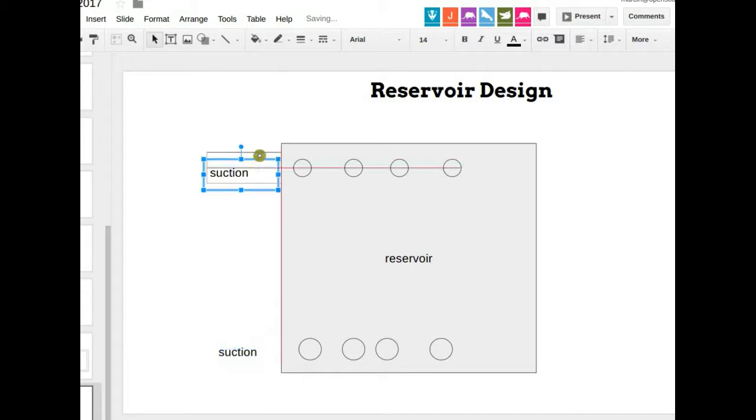These are just holes that are going to be torched with the CNC. This is all automatically placed in, and then we weld fittings into that. So that's suction, and this is return. What happens at the return? The return is going to have a quick coupler. So you can quick couple as many second, slave power cubes as you want to this, including the first master power cube. So at minimum, you're using one of these in operation. And a suction would just have a valve.